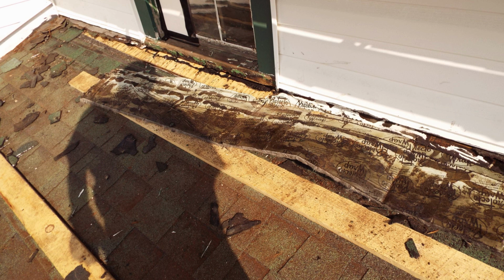Now, the core vents can't be used with the metal roof, but I was going to make an attempt to do so by raising it up. However, I didn't get the chance. So they laid that down, but what they had done, and I realized it later, when you see right here that it was raining inside the porch, the tape that they pulled up was also the flashing tape that I had up in under the side of the house. So therefore, in a rainstorm out of the south, it rained in the porch.